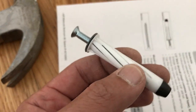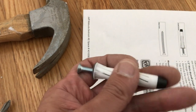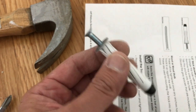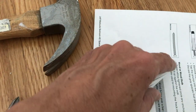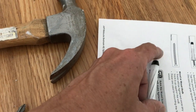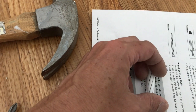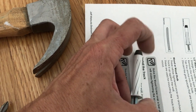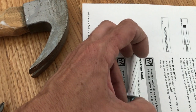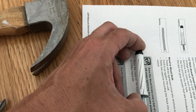This is an Alpha wall anchor. It's got the screw in there, and this dark plastic piece down there is sort of the end cap that it screws into. After you've stuck this in the wall, got the railing on, and tightened it up, this plastic part — it's really flexible — starts to contract and really grips; it bunches up at the back and also in the middle. So it really grips into the wall, and with five or six of those you can hang a couple hundred pounds — seems like a very effective system.